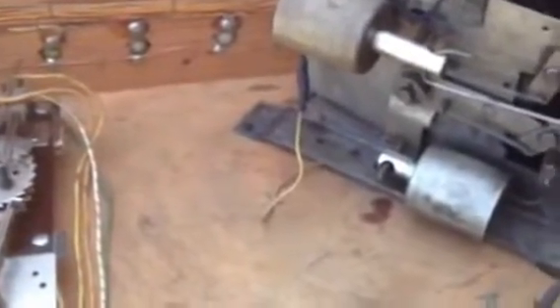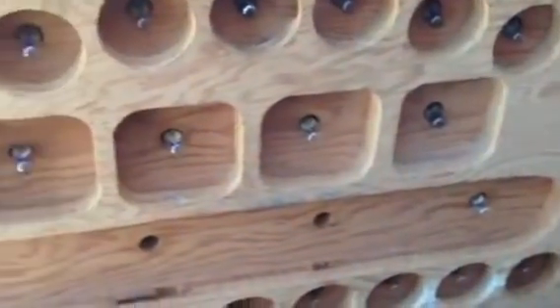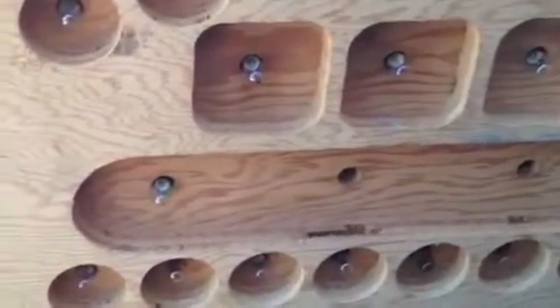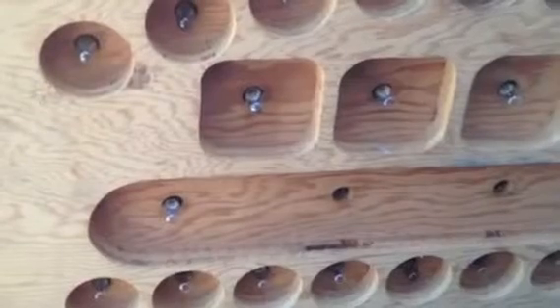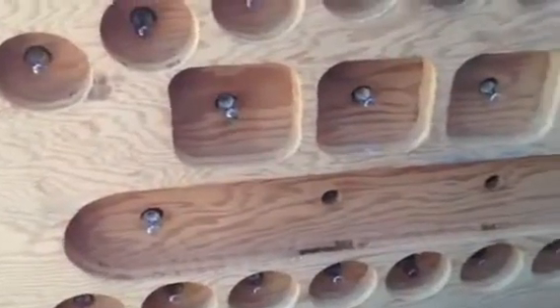The next video will show the game working and scoring. In the front here, we took all the light bulbs out — every one of them — and we cleaned every socket using Q-tips and non-acetone nail polish remover. Swab it twice, circle it around, dip it again and circle it around. That gets a lot of the carbon and buildup off. I also did that to each light bulb. These are vintage, nice, conditioned light bulbs. Two of them are broken, so we're going to have to stop at the amusement store in Rochester to get some replacement bulbs. All the rest look really good and are cleaned up and ready to go.